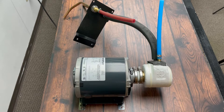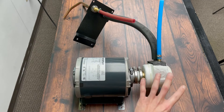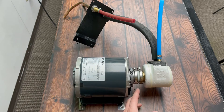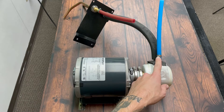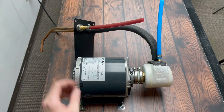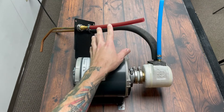Today we're going to be looking at replacing the glycol pump that came with the UBC glycol chiller, which cools the beer lines on your system. This part here covered in styrofoam is the actual pump; this is the motor. We don't do anything with this. What we're going to be doing is removing some screws and connections from these Oetiker clamps and putting the new pump on, reconnecting our glycol lines with screw clamps.